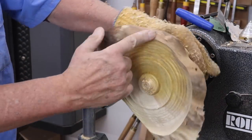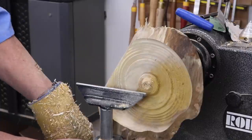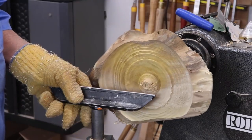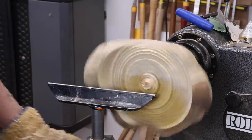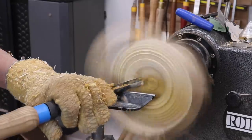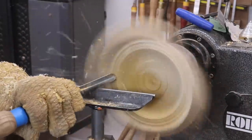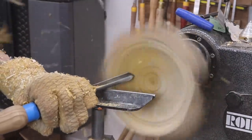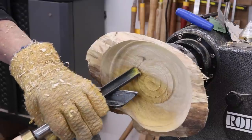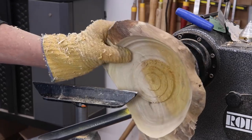I can always go back and revisit this and work on this thickness, but I'm going to come back into the center and do a little bit more hollowing at that point. I'm going to change my tool rest so I can reach that a little bit better. It looks like a spindle roughing gouge, but I promise you it's not. So I'm going to go across the bottom of that and determine the thickness on the very bottom of my bowl.